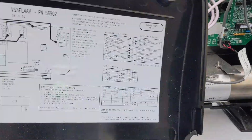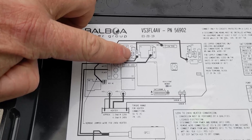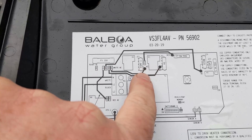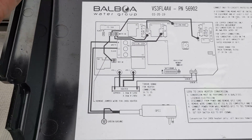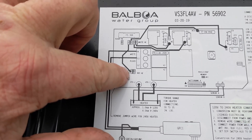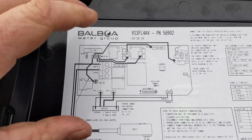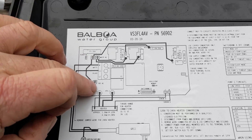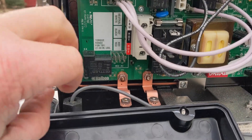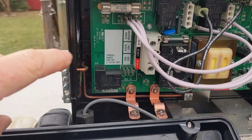If you're unsure, look in the back. Here we have pump one right there, and it's going to be the white beside it. We're going to move it from there down to here. On your new one, you're going to have a jumper wire — a white from there to red AC. That's only for 120 volt. If your tub's 120 volt, keep that jumper across here. If you have 240 volt, make sure it's gone — I've already taken it off. You want to take that wire off if it's 240 volts.